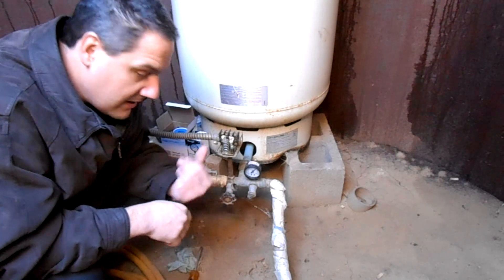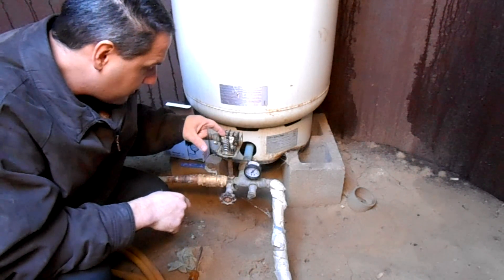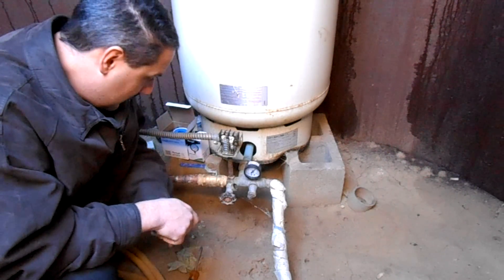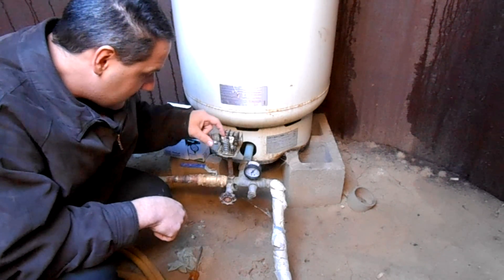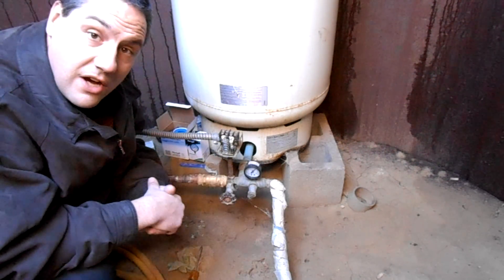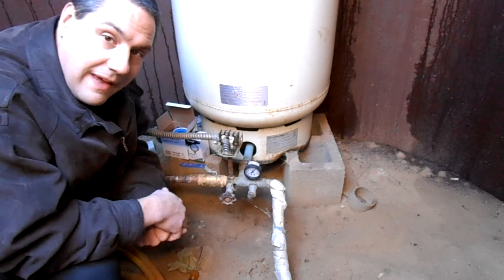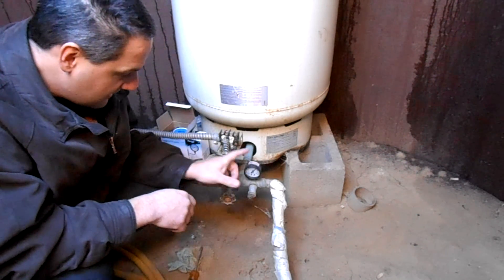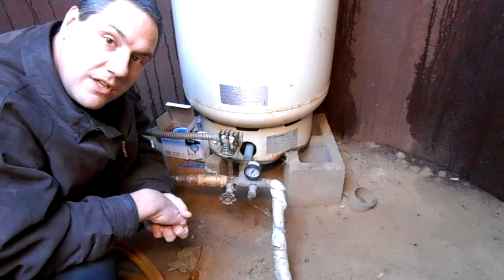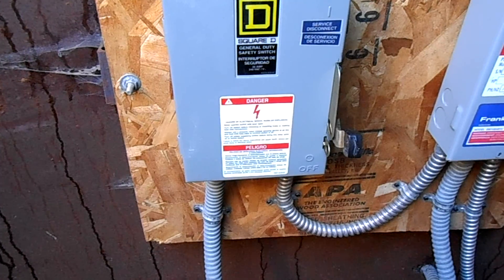We're back at the main well pump area. The pressure switch has been freezing up the last few days — it's been pretty cold — and I'm going to replace this unit. The gauge is off too, so since I have to tear the whole system down anyway, I might as well put a new one on. It's only about $8. So I'm going to replace both and then repressurize the pressure tank and we should be all set.